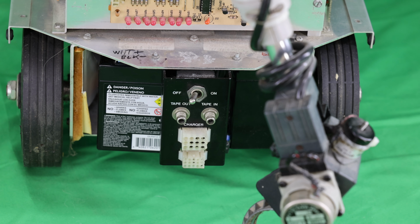So the kit that I'm selling is basically just the Cortex that I showed you with the adapter hooked up to it, which you can build yourself out of your own parts and just hook up to the VEX Cortex. You can just use standard jumper cables, the kind that you use for prototyping kits like Arduinos and Raspberry Pis. And then basically either get a Molex connector, you need a male connector, or use just nails stuck into the connector there, as long as you don't short them out. You've got to be very careful not to short any of the pins. And of course you can just coat the pins with rubber tubing just to protect them from shorting.